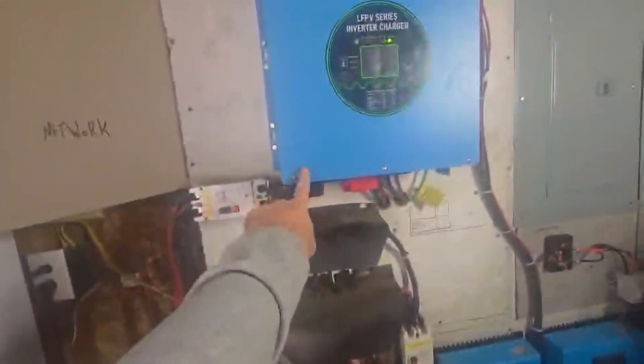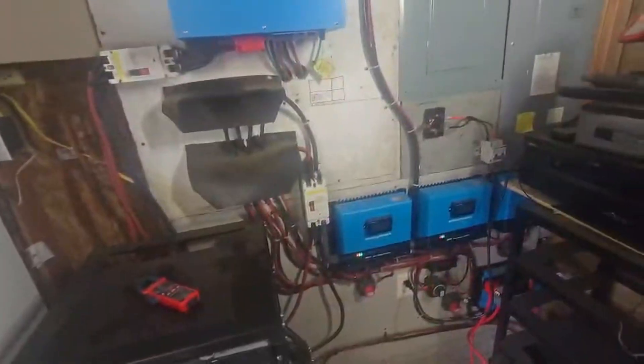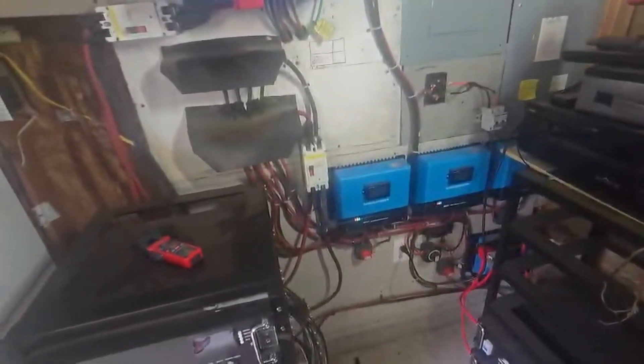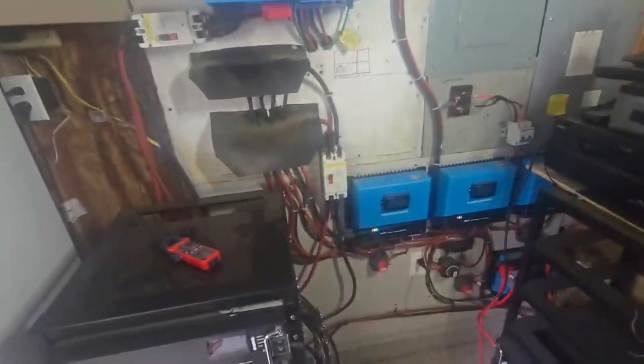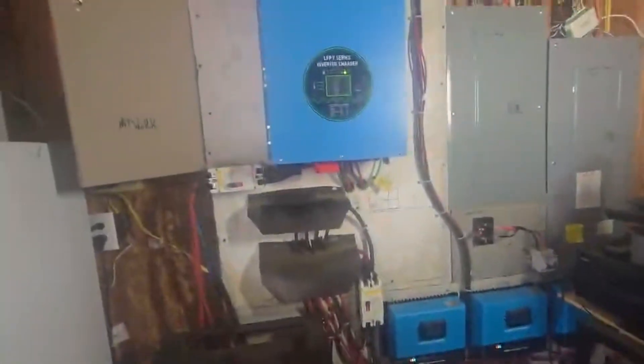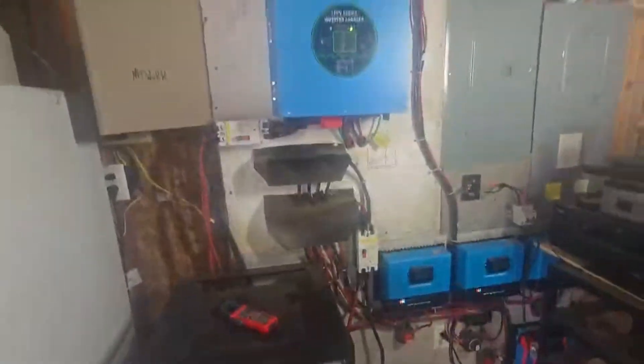In the winter I still have the oven and other loads that pull from commercial power. But if in the summer I had two arrays - about 9,000 watts per hour - selling back to the commercial power company, I'd build up enough credit to offset my higher winter bills. That's probably the only thing I would change: add another inverter and a transfer switch for two of the arrays dedicated to net metering.